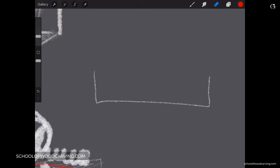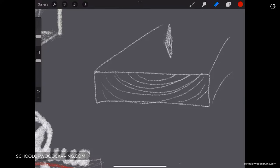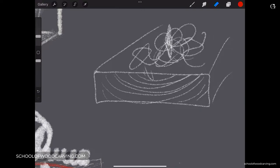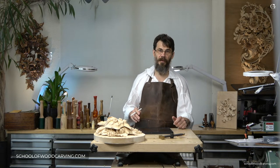If you have a piece of lumber, I'm going to draw the plane cut, and I'm going to draw my grain direction that way. This upper side is going to be my carving side, because I try to break that force from here. I don't want to carve on the opposite side, because you're breaking the outer force, but not the inner. You're just pulling everything toward the center. I hope it makes sense, people.